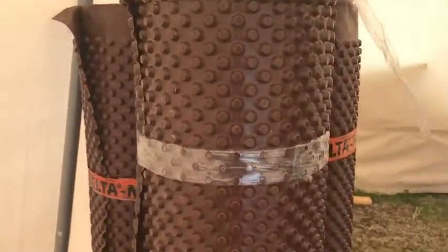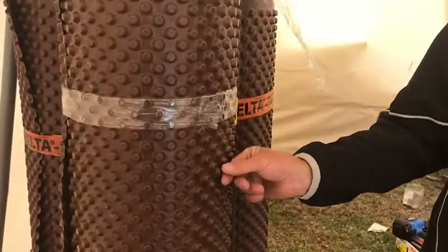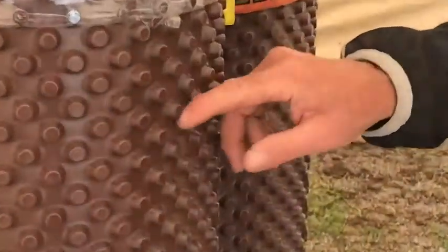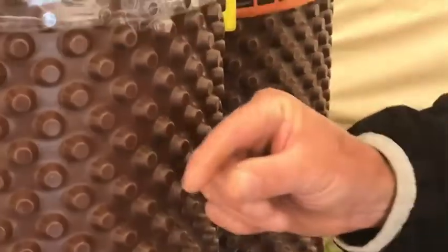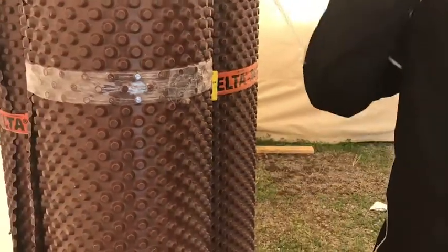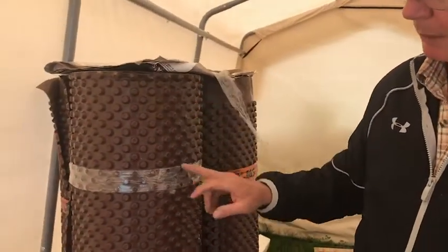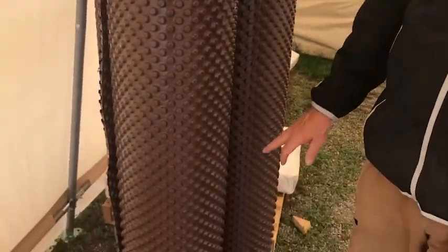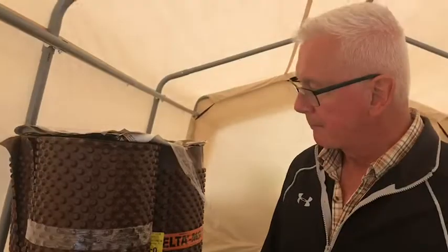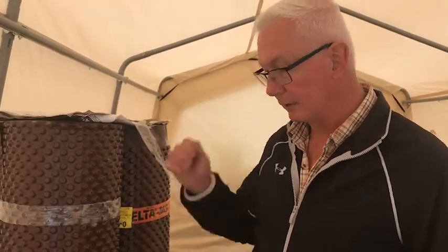So it goes arranged along the side of the foundation below grade as well, and basically it hangs on the side of the wall, and these dimples cause this layer of plastic to come out from the edge of the foundation wall about 5/16 of an inch. That does 2 things. It creates a drainage space so that if any water does happen to make it in behind, it has a place to drain down the wall and down to the footing and down to the drain tiles, instead of just sitting there saturating and soaking into the foam.